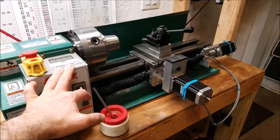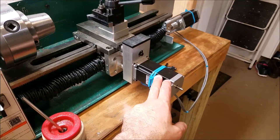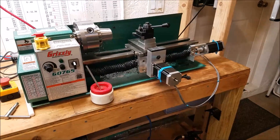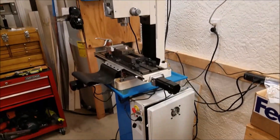So what we're doing — the good old mini lathe here, I'm going to show it a little bit of love. We're going to upgrade from these Long's Motor open loop steppers to a closed loop stepper system, just like the ones I used on the Precision Matthews milling machine over there.